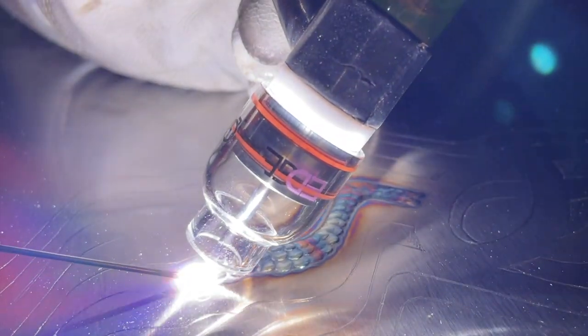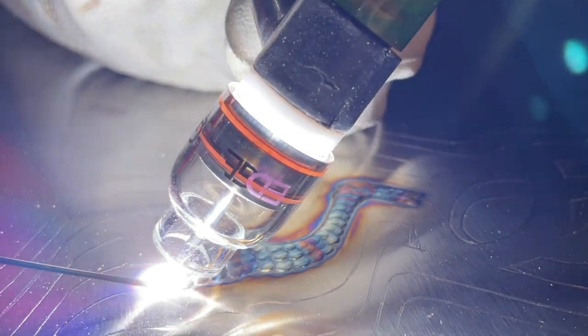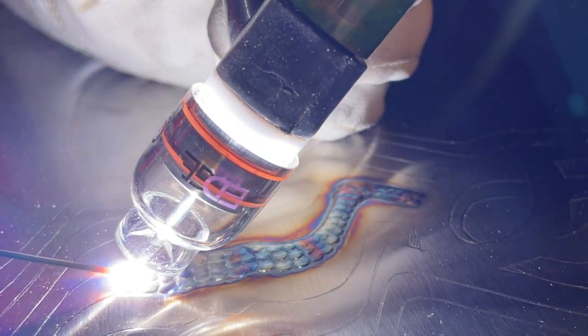As you can see here, I'm switching between two and three step — it's a weave pattern, so I'm actually making it wider as I go along. It's something I can plan for a little bit. However, when I'm getting into passes like these I kind of just have to freestyle it as I go. I make up my mind about how much filler rod I need to use and I just see where it takes me.